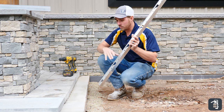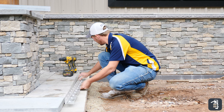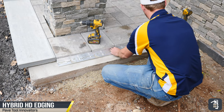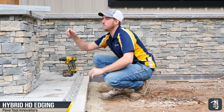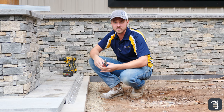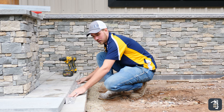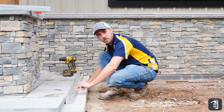What we're going to be using for our edging is the Quickie HD hybrid edging. We've cleaned off all that number nine stone so we're nice and smooth here — we're just going to set this into place. I already cut it using just a pair of snips; you can cut it with snips or a diamond blade. A lot of guys have diamond blades on the job site. If this were a driveway application, I have my tabs — I could flip my tabs up.